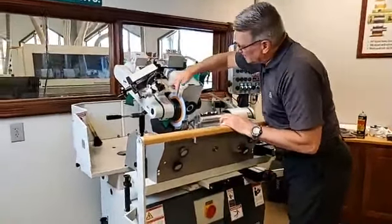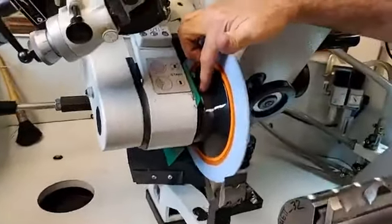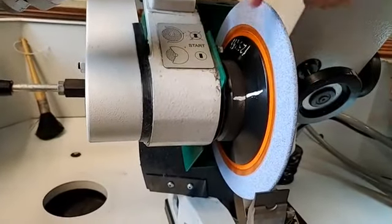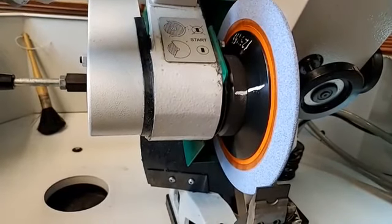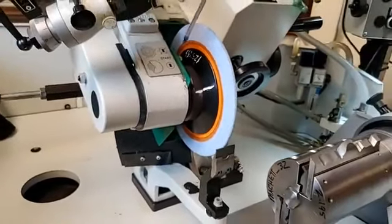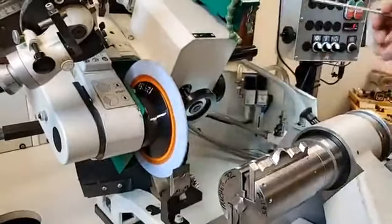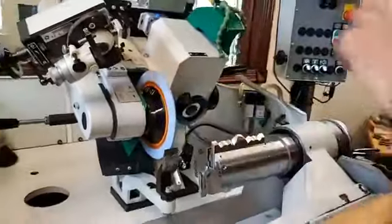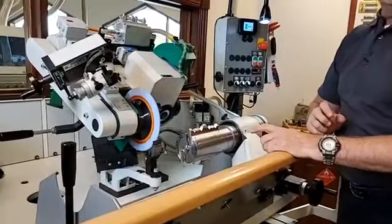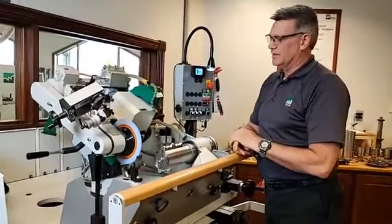Christian, if you can come in just a little bit. I don't know if you guys can see this. I'll roll it around to these white lines. In the past, this area, which is the spindle itself, used to be just a slick black surface, just like the hub. And once we get that coolant on our hands, it's very difficult to hold that thing still. So what a lot of people would do is take some kind of a tool and wedge it in there and then pull the wheel loose. That was very hard on parts up in here and on the spindle itself. So what you could see there from when he was zoomed in is those are now knurled. So it's very easy for us to hold that area and pop that wheel loose. We don't need tools to do that.